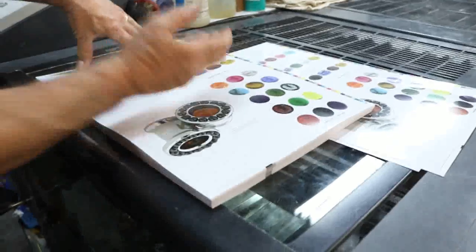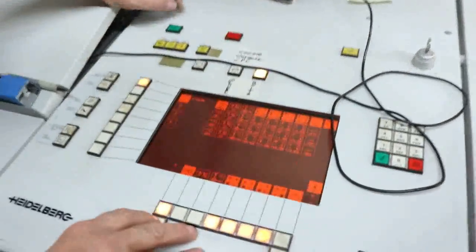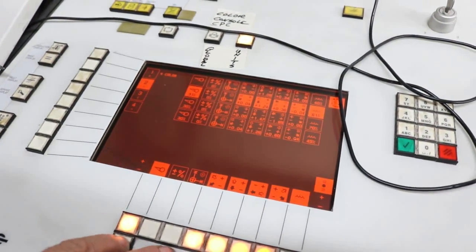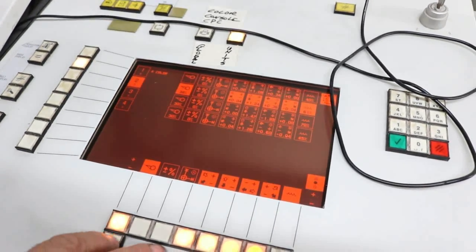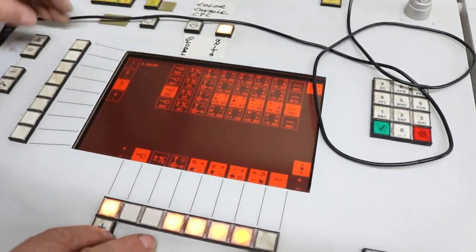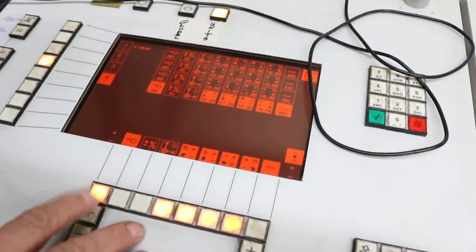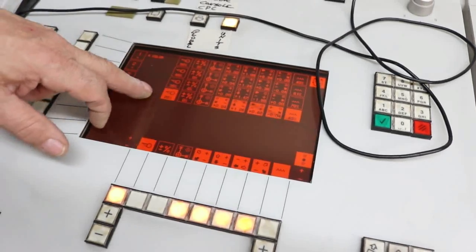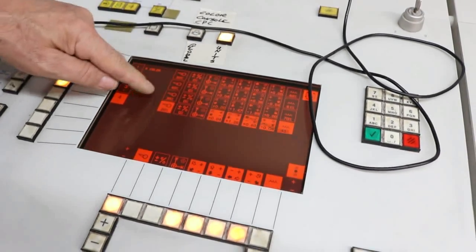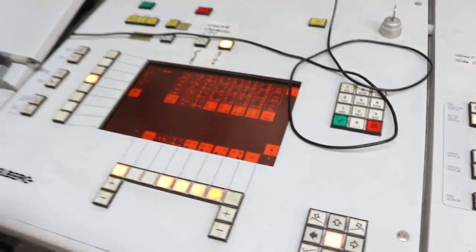So what we're going to do is we'll bring our black up 20 points over here from 30 to 50 on the sweep. We'll come up 10 on our magenta, and we'll come up 5 on our cyan, and we'll go down 10 on our yellow. We don't want to get too far below 20, and we want to try to keep some latitude of adjustment upward if we need it for the other 3 colors. So ideally you want to start out around 30 and move from there. So that gives you a lot of latitude of adjustment.